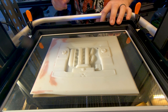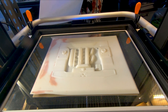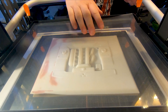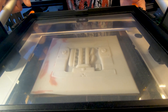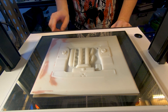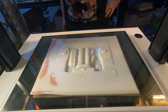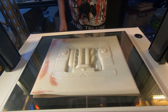So let's get some plastic in this and give it a mould. Take the coating off, make sure you've got the clear side up. Put your frame in, lock your frame down. You want to make sure these clips feel nice and snug otherwise it will pull out of the frame. Push the buttons — as you would have seen in the last couple of videos, it's easy to set these up — and you wait for it to heat up. Nearly up to temperature now. Once the pump kicks in you know it's up to temp and you get ready to pull the handle down.